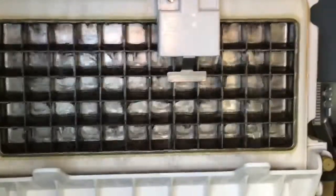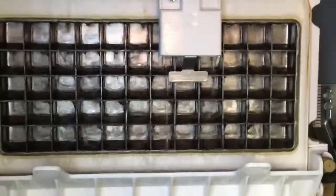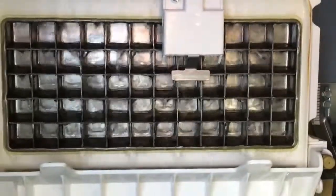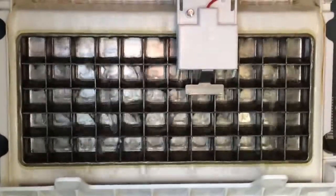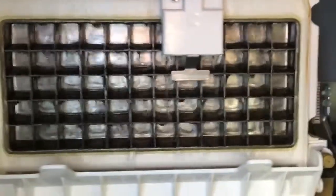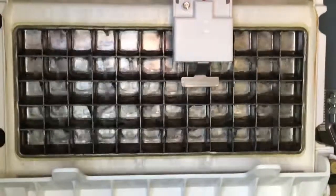Yeah, I'd gotten the designations of what the lights did wrong before. The reason the red light was flashing earlier was because the ice was contacting and then not contacting the ice bridge thickness contact, which is again this thing right here, that piece of metal. Alrighty. Again, green light is on. That means the bin switch is closed. Again, the bin switch is this thing right here.